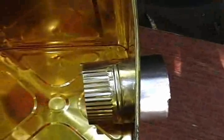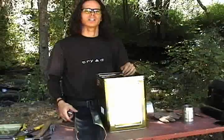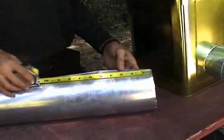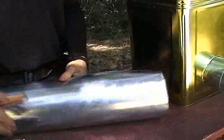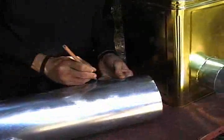The four-inch piece of stove pipe is inserted into the can with the crimped edge towards the inside. The elbow goes over top of it with the crimp side coming up. The next step after you have your elbow in place is to measure out five inches of the long stove pipe to cut.